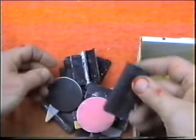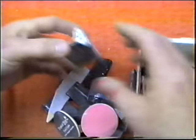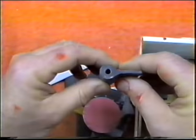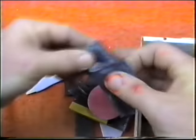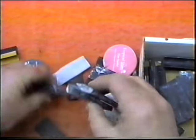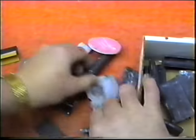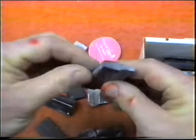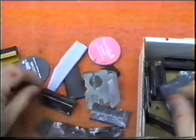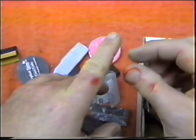Of course, these come with that Porter Cable tool, and they've got all kinds of shapes here. But I like to find one that's just a hair under the diameter. Now this one, of course, is on the big side. That one's even bigger. We'll find one here that's just a little bit less than the diameter. This usually is the one that works. Look around. If I don't have one, I'll run this on a sanding belt until I make one. But I want to have one so that the radius of the fillet is just a little bit less.